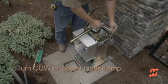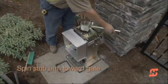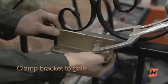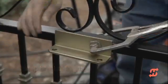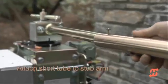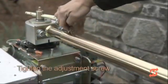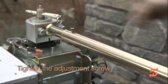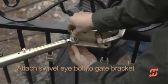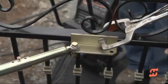Returning to the installation steps. Extend the taper handle and turn counterclockwise to loosen the taper clamp. Spin the stub arm so it faces the gate. Clamp the bracket to the gate making sure it is level and aligns with the crossbar. If a horizontal cross member does not exist on the gate, install one. Slide the short tube onto the stub arm and tighten the adjustment screw to temporarily hold the arm position. Attach the swivel eye bolt to the gate bracket and secure it with the fasteners provided. The swivel eye bolt allows for incremental adjustment and misalignment of the arm assembly relative to the gate.